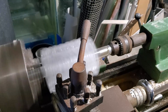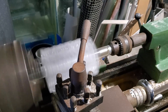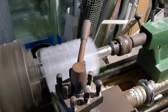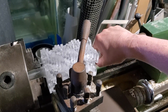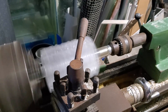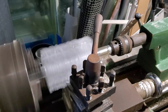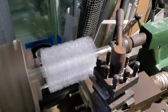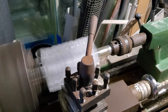I've never done this before, so what I did first was turn it on and just let it run for 30–40 seconds, then turned it off and put my hand on it to see if it was even remotely warm. You'll notice throughout this video that every time I turn off the lathe I put my hand on this joint, and you'll see me give a thumbs up or whatever as to whether it's warming up. As a spoiler: it took about an hour or a little more to turn this down to the right diameter, and it never warmed up — it never even got to the point where it felt not cool to the touch. It always felt cooler to my hand than my hand itself, so it never even got up to body temperature, which I think is cool.